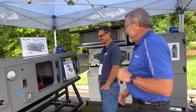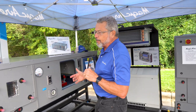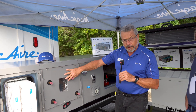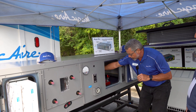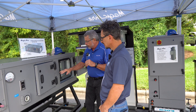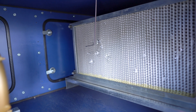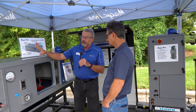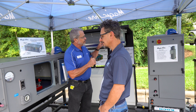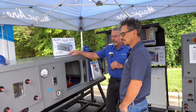This last unit is a critical environment air handling unit for typically a hospital or medical application, maybe pharmaceutical. We start with a two-stage pre-filter, up to 12 rows of coil, then a plenum fan — a Ziehl-Abegg plenum fan assembled not far from here in North Carolina — and then a final filter that's either MERV 14 or HEPA. It takes a lot of air power to push through all that. This huge unit is 400 CFM nominal just like the little fan coil over here, but with two-inch double wall construction and completely different capabilities.